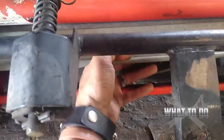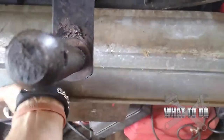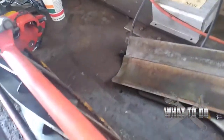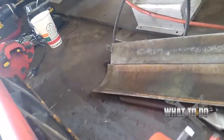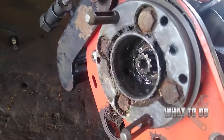I got my nuts and bolts off each side of the shroud. Now you just want to pull this out very carefully — like so — and set that aside. Now you're going to have a lot of nuts and bolts on this project, so what you want to do with the nuts and bolts from that shroud is either put them back on here or back through the holes that you took them out of, which is where the gear motor connects.